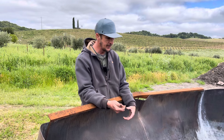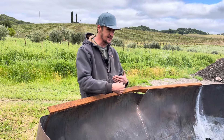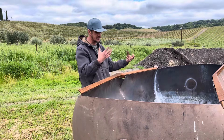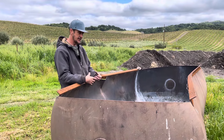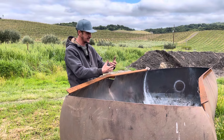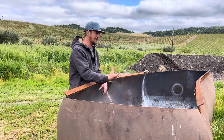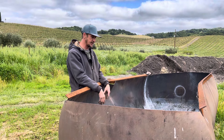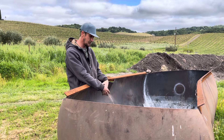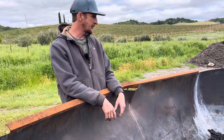As the heat pushes those gases out of the wood, those gases are then combusting — that's where you see the flame. The idea here is we create, with this tank being concave in nature, a smokeless fire. Any smoke or particulate matter that tries to escape or roll out of the kiln — because of the concave shape — the fire and heat sucks that particulate matter back into the flame and it's consumed rather than going into the atmosphere.